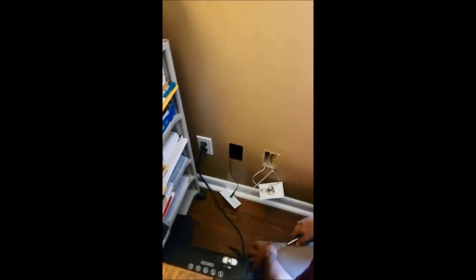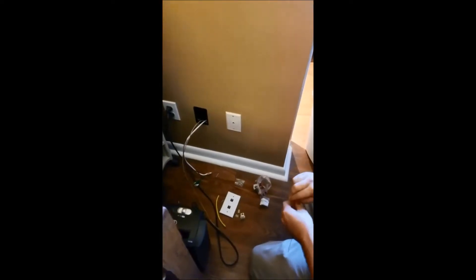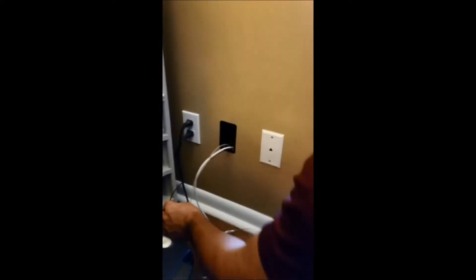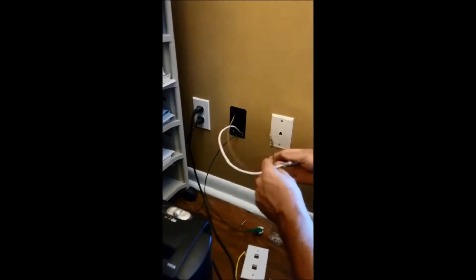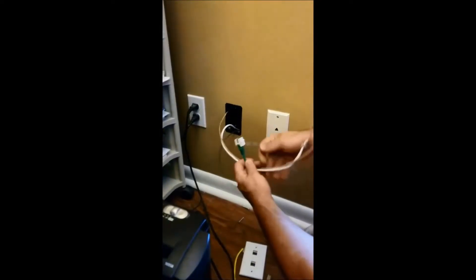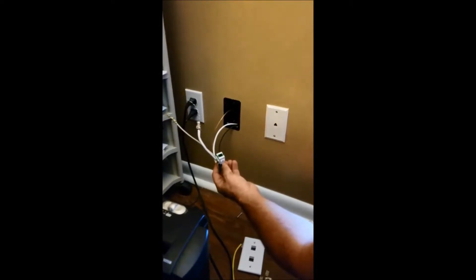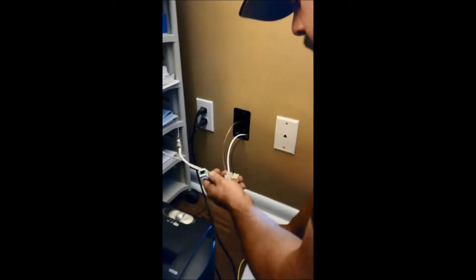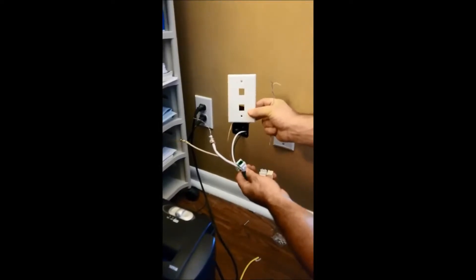We'll make those connections after the fact and tie everything in. Now that we've identified the wiring the customer wants hooked up, we're able to extend one of the wires with a new line, and the other line we were able to get through that same junction. So everything connected inside the house — the new line we ran and the new cutout — will all go in the same faceplate. We'll connect these two wires to the faceplate and install a two-port faceplate instead of a single, so the fiber comes through here and the telephone lines go back out through here.